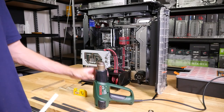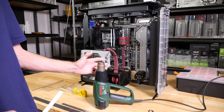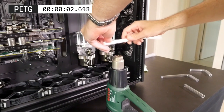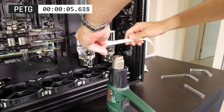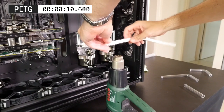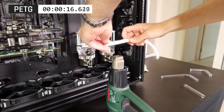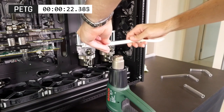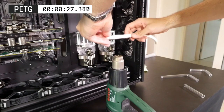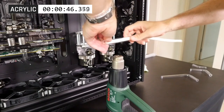For the heat gun, I use about 350 degrees, or maybe 300 degrees if you don't want to go so quickly and aggressively. It also depends on the tube. If you have PETG, it heats a lot more quickly and can bubble a lot more easily, so you need a lower temperature — 250 to 300 should be fine — and it may be ready to bend after about 20 seconds. But acrylic can be harder, and there are different hardnesses — some tubes are harder than others. It can be 30 seconds, even a minute, so that's when you want to go more aggressive on the heat.